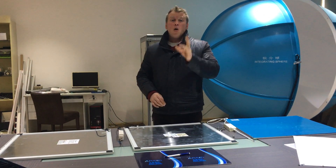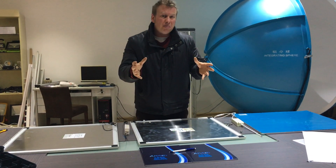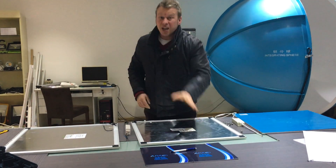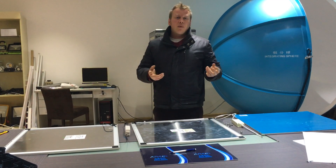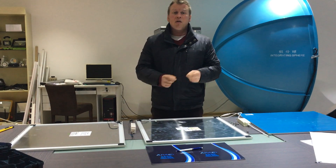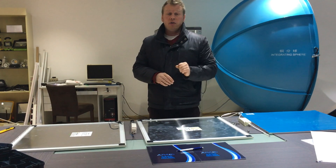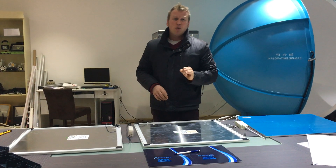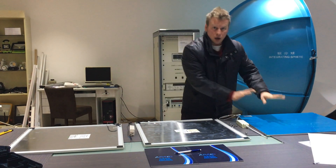When you walk away from a job and you've fitted it — it might be a nice office, whatever — you might want to save the person money. But will the lux still be the same on the desk in a year's time? Lux Review and LIA have already said that cheap panels will deteriorate after 1,000 hours — that quickly they'll deteriorate. Our panels — I know the in-situ testing — we've got 54,000 hours on the L70 alone. That's the difference between quality and not quality.